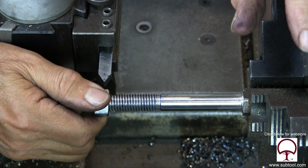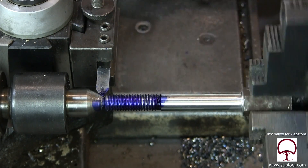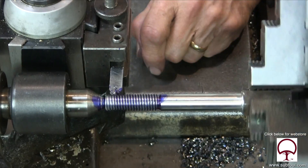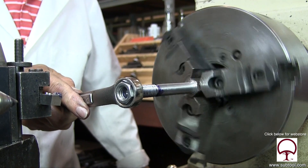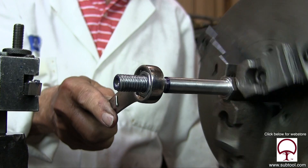It's a little stubborn, so we're going to put the center back in, zoom in again, and come in here to pick it up. Take just a little bit off. Check it with our wires one more time — seems okay, but we need to take just a bit more. Now the nut — remember the surface is a little bit on the rough side when you're cutting a thread like that. We decided it was just as easy to run the nut up there with a wrench on it and kind of clean the thread off. We also cleaned it off with a wire brush and that seemed to help.